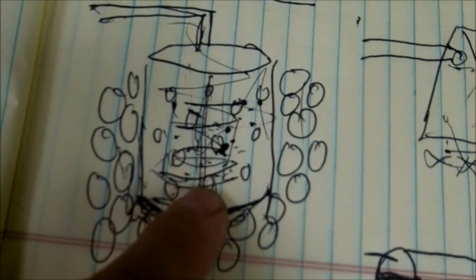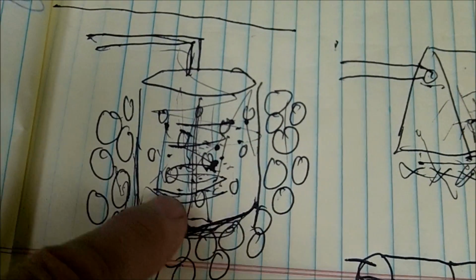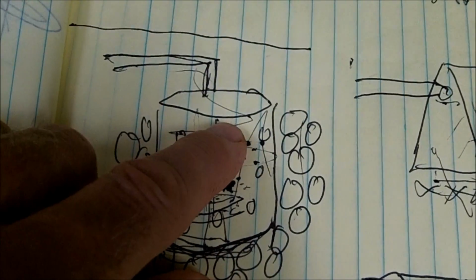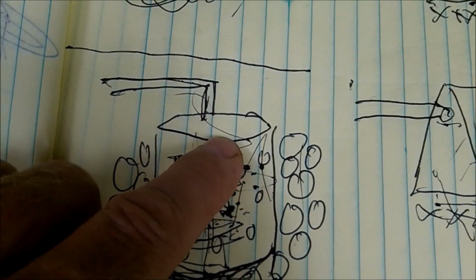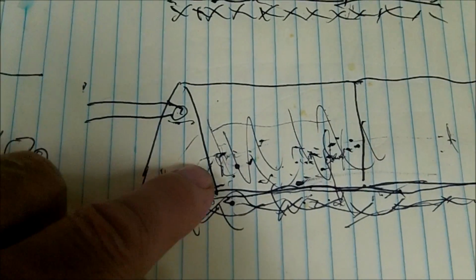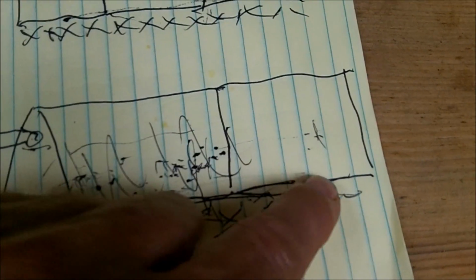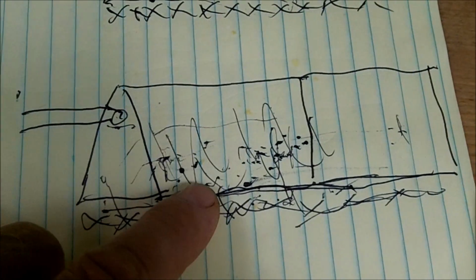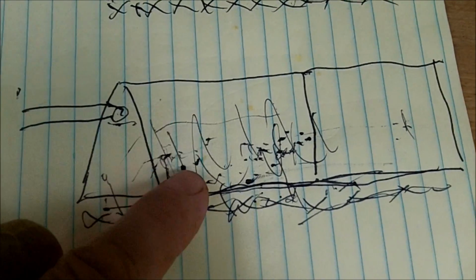With the vertical barrel technique, the soil around it tends to get saturated with grease, and then they fill up with water, and that's when it becomes problematic. With the biochambers, the water is dispersed much quicker. If it didn't work as good as it does, it wouldn't be the mandatory requirement for household septic systems.